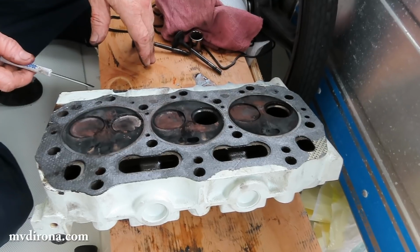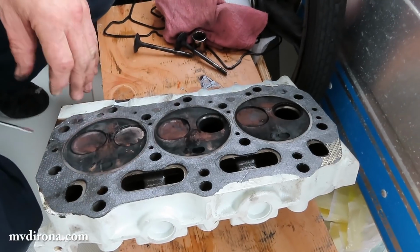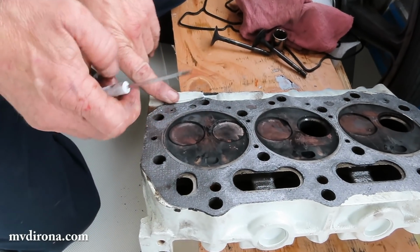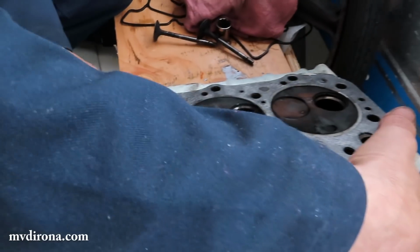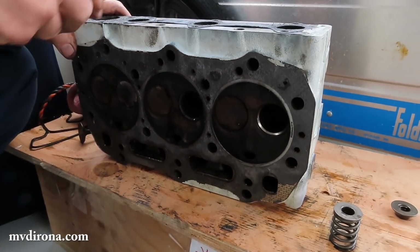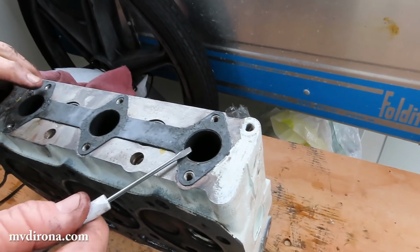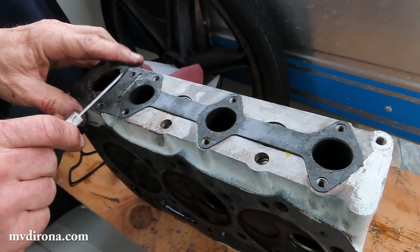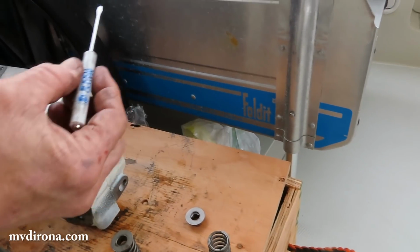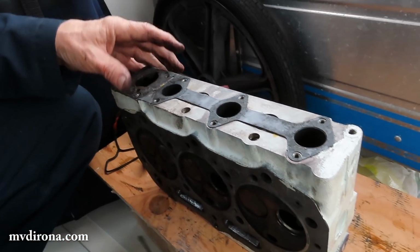And the water flows from number 3, which is on the right, to left, and so that's why it would be the worst. There shouldn't be any water, but if water did get in, it would go from right to left. These exhaust valves are opening up to here, and so this exhaust valve goes to there, and this exhaust valve goes to there, and then the exhaust from here flows to there, and then out of the boat. So if any water did come in, it would first arrive at this cylinder, then this one. That's why it would be the worst.